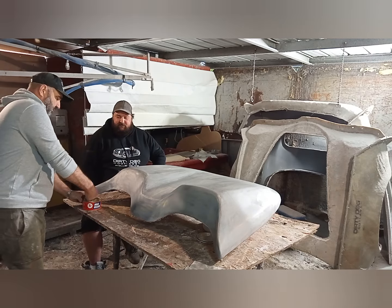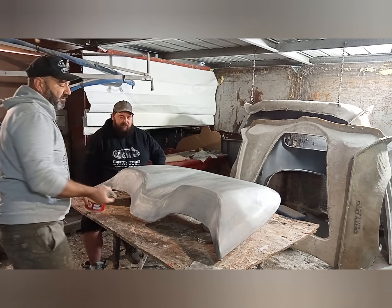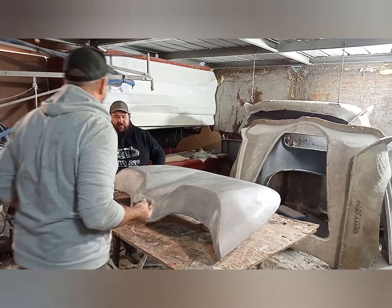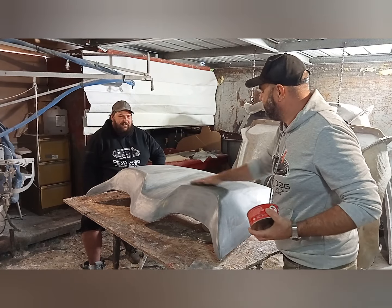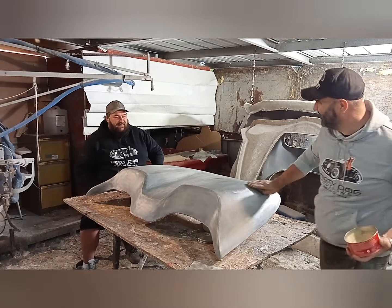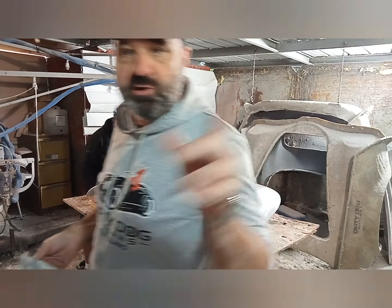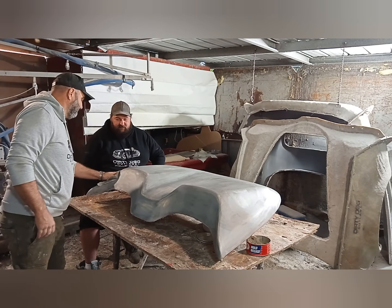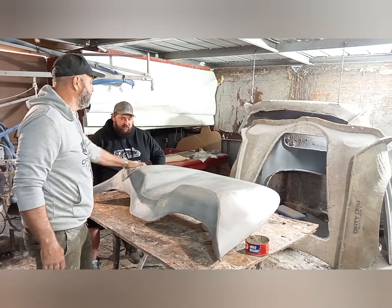Now, you just see me just wax here. Wax on, wax off. I learnt this from Mr. Miyagi. He taught me how to do it. Should be waiting in between each wax. I'm not waiting, no. Have we ever had a problem with delamination? It always comes off, doesn't it? All right, so we're just waxing. I'm going to do another 4 or 5 of these, and you're going to see every single one. And then I'm going to PVA. And then we have to wait for the PVA to dry.